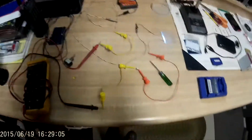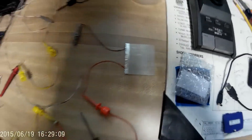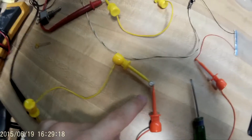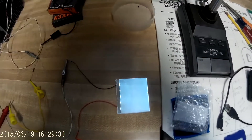I just got my front light kit in and wanted to show a little demonstration of it and how I'm going to put it together. What I've got set up here is a power supply, a 47 ohm resistor, and a 200 ohm trim pot. I've also got my multimeter in line to show how much current it draws. I'm going to turn the power supply on - it's set at 3 volts. You can see how much light is being produced, and I'm drawing about 6 milliamps.